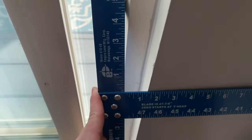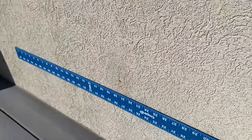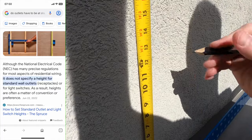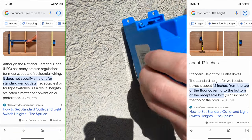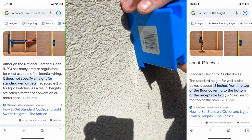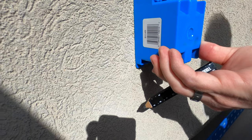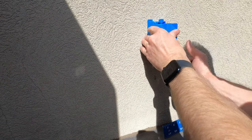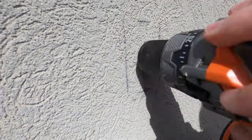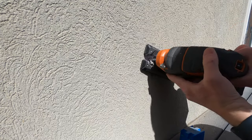I'm going to do a measurement based off a known reference point — in my case, a sliding door visible both inside and outside. If I measure the distance from the inside center of the box and then measure the same on the outside, I should get the exact placement I need. The bottom of the box I'm putting at 12 inches — common standard is 12 inches to the bottom and 16 inches to the top of the box, measured from finished flooring. I drilled into the center of where I wanted my box, and hit insulation — good news, no stud or back of a box.